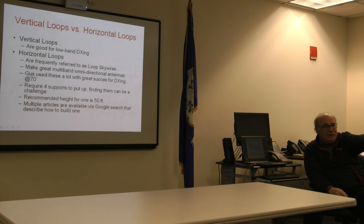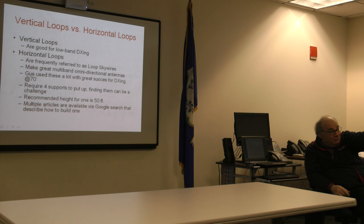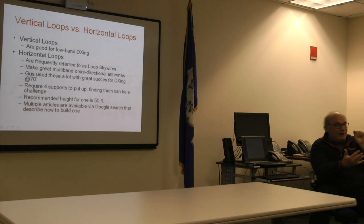I think it was actually DB9 in a null modem connection mode, maybe. And you operate it remotely. So no kidding, the distance from the base of the loop into the shack, 30 feet. And every time you switch bands, you hit the remote tune button, and zoom, up it comes. I'll just tell you, you can do that. And so again, from the tuner to the antenna was just a short link to the ladder line. It was coax to the tuner, the remote tuner from inside the shack.